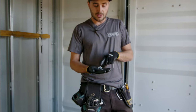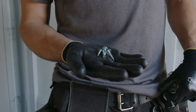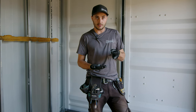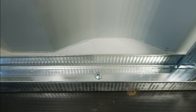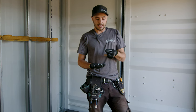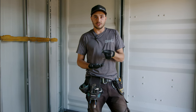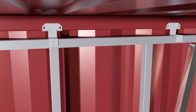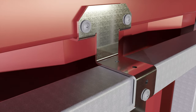We have our quarter inch hex head self-tapping screw. We use a number eight wood screw that connects the bottom track to the wood floor of the container, and then we also have our number eight self-tapping sheet metal screw, which connects the studs to both the bottom track and the top track and also into this steel stud bracket of ours.